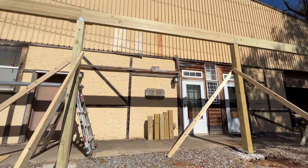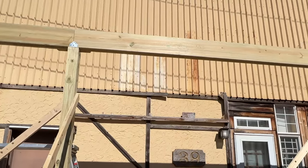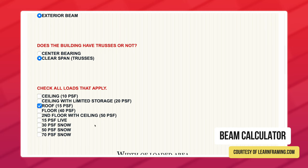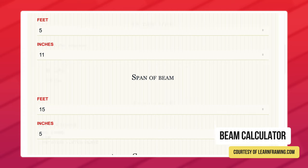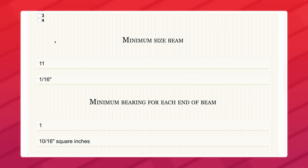Once all the posts were cut to their final height, it was time to start getting the girders assembled. I used a two-ply two-by-twelve for the girders. To figure out the size, I used a great calculator on learnframing.com — I set it for an exterior wall with a clear span, added a 15 pound per square foot roof load and a 15 pound per square foot snow load, which is the correct number for Asheville. I entered the width of the loaded area — the distance from the building to the girder — and the span between the two posts. I selected number two pine, two plies, and got a minimum girder height of 11 and one-sixteenth inches, so my 2x12s at 11 and a quarter tall will work fine.